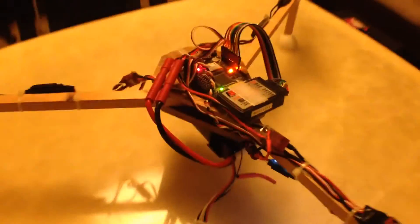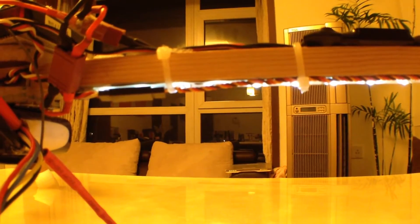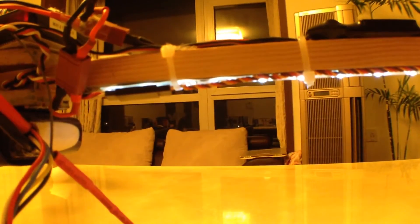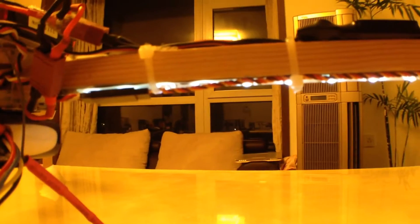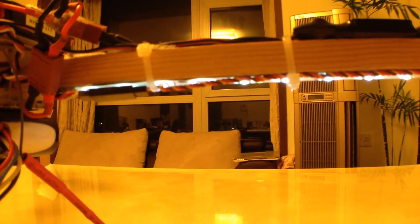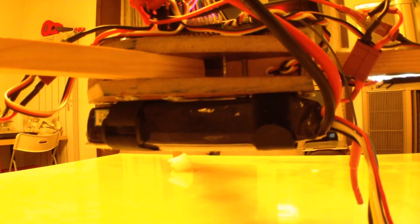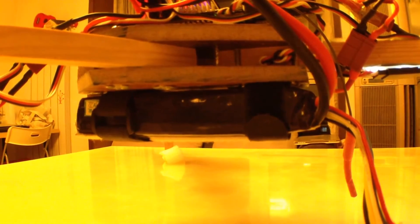At the bottom, I've got an LED strip — partly to make it look good, partly to know which direction it is. That LED strip, combined with the foam head I created for it, helped me know the direction when it's like 200 meters up, because it's hard to know the direction at that height. I've connected this LED strip to a variable resistor so you can adjust the brightness of the LED, which is pretty useful. There's my battery pack — a 14.4 volt, 50C, 3000 mAh battery.